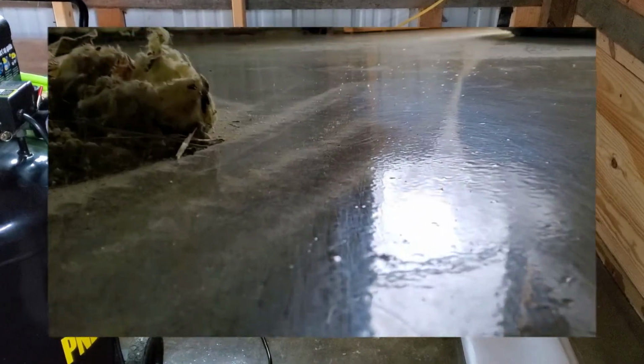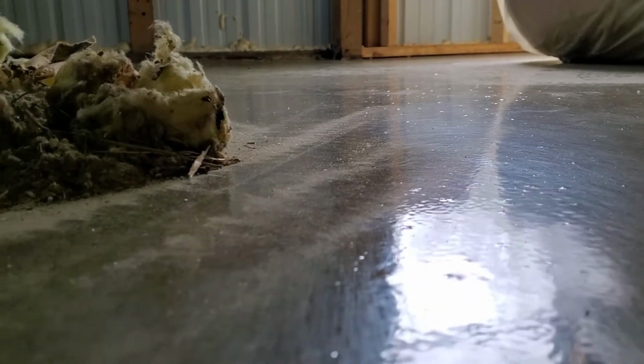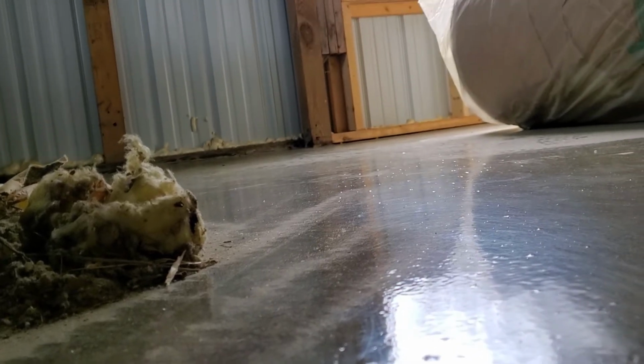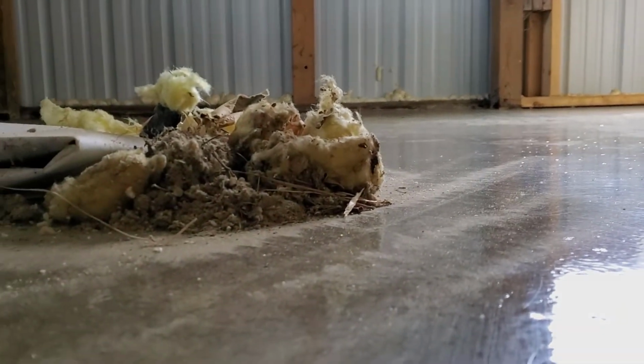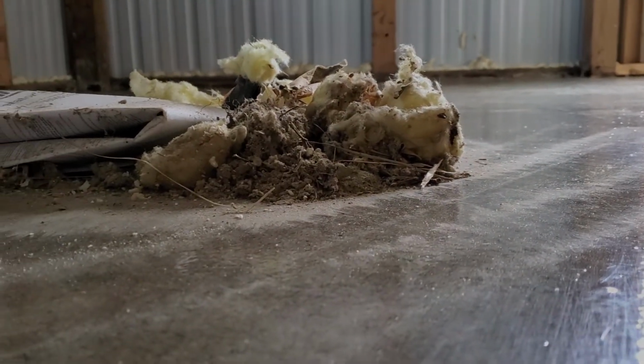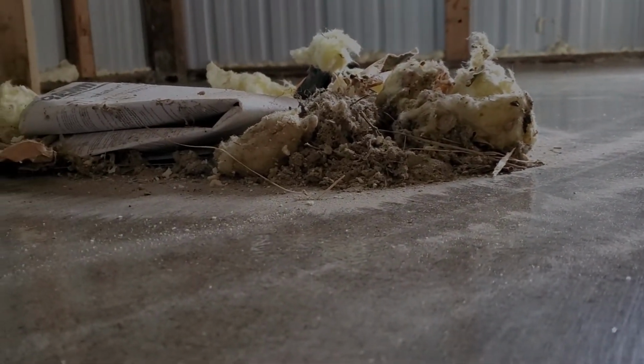Additionally, we took advantage of the building being empty and went ahead to seal the concrete floor slab. We looked around for the best and most durable materials we could find and ended up going with an epoxy base coat with a polyaspartic top coat. In addition to providing a durable, easy to clean floor surface, it also looks pretty nifty if you ask us.